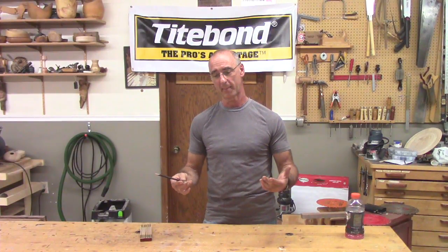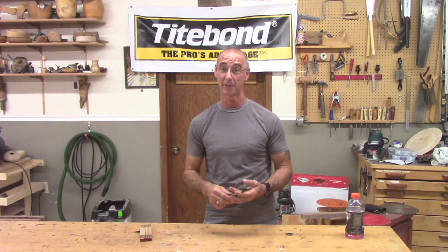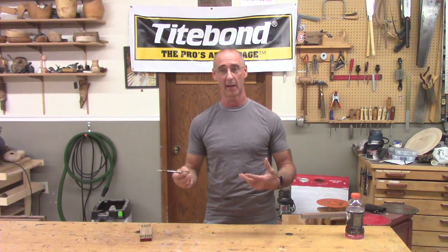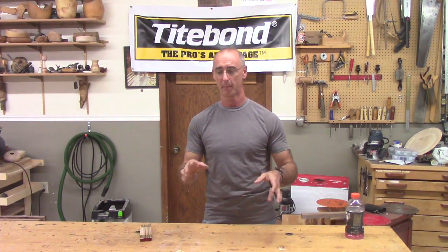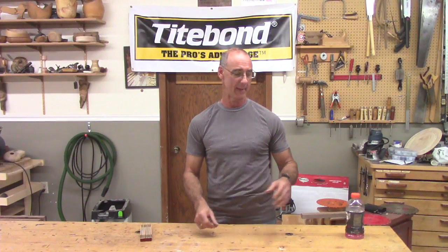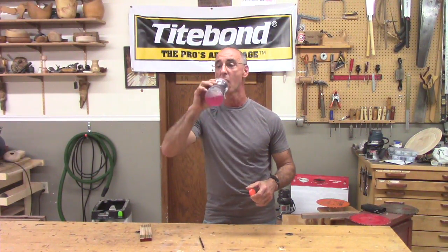You know, and if by big box store plywood you mean like BC plywood, that's a real bad choice because it tends to be so cupped. Maybe the cabinet grade, you know, the red oak plywood a big box store sells or maple plywood might be a little bit better. But the best choice, MDF or multi-ply plywood for jigs, will serve you much better.